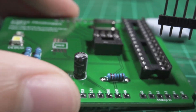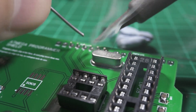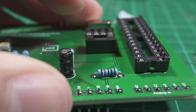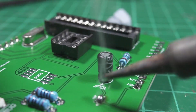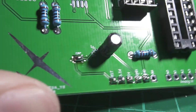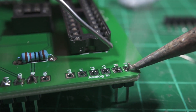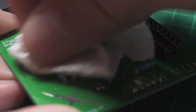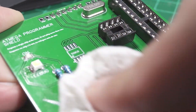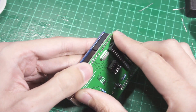We're almost there — let's solder the pin headers. The 10uF capacitor is optional for the ATmega328P, so I added solder pads to complete the circuit when needed, allowing you to solder or desolder some tin on it. I know people might suggest using pin headers and jumpers to activate or deactivate it, but I forgot, so I'll do that in the next design version. I'll use some alcohol to remove excess flux from the soldering stage.